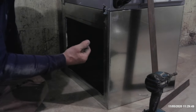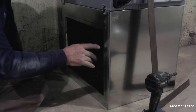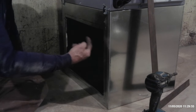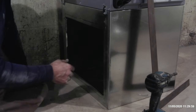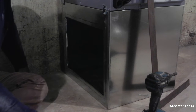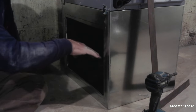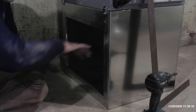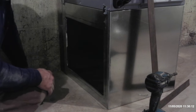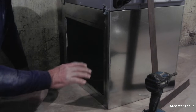In the old days, we would go ahead and make dovetail fittings and everything, you know, all fancy. And in a lot of cases, we would actually dovetail the furnace and curve them around the return air duct if we didn't have a return air 90. Those kind of things have kind of fallen by the wayside unless you get prefabricated return air drops, and then a lot of times they will come with the dovetails and stuff already fabricated, and you just cut this out and fold those dovetails over. And I still fabricate things like that too, but not on every project.